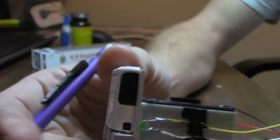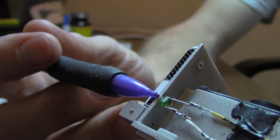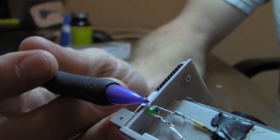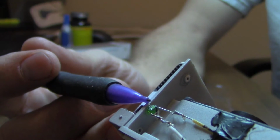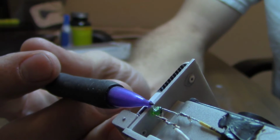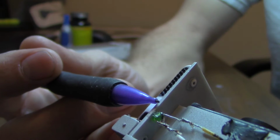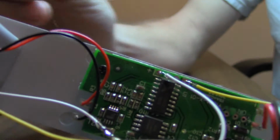So on this end, the LED that I'm using actually is the green LED from an Oregon Rail Supply HO Scale signal kit. I don't use their LEDs when I build the signals, so I have an abundance of these size LEDs left over, and that's why I have green, yellow, and red, although I've never personally seen red in a container unit like this in real life. These LEDs are, I think, 1.8 millimeters square. Obviously one connection is the positive anode, the other connection is the cathode, and you want to make sure that you match the polarity of this LED up correctly to your circuit board.